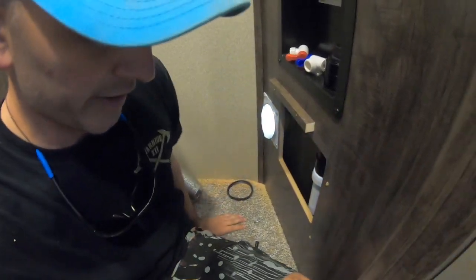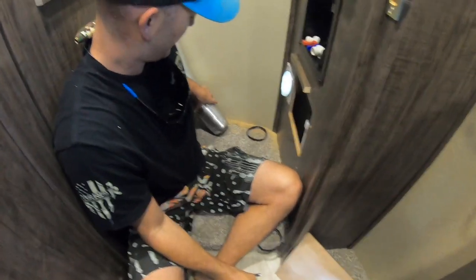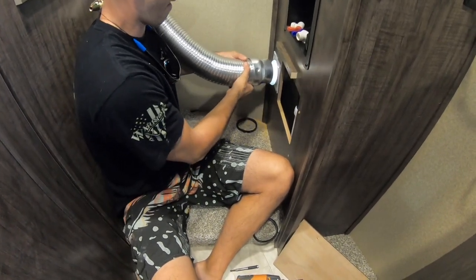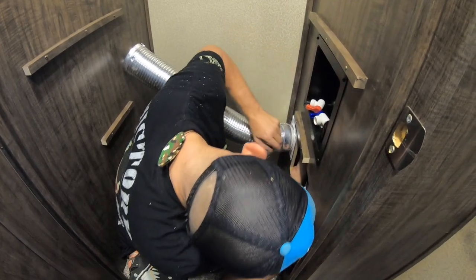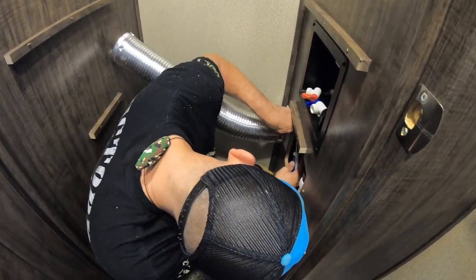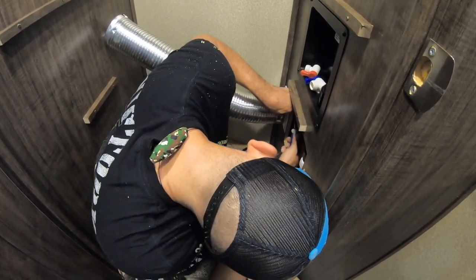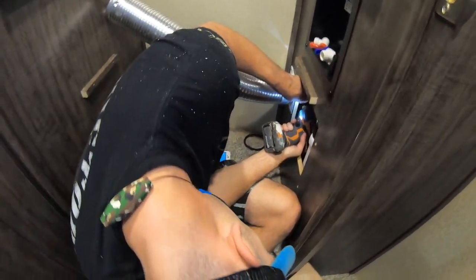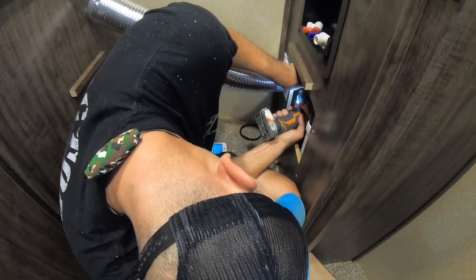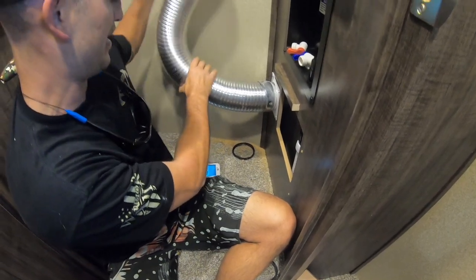Our interior flange has been installed. I'm going to give it a little tug to make sure it's nice and stiff. I'm switching to a five-sixteenths inch nut driver for the clamp. As I slide this dryer vent sleeve in, I'm going to push against it firmly — not really hard, just like so — and then hold it with one hand and make sure our vent clamp is in a position where we can get our drill on it. Sometimes you have to take a screwdriver and tighten it up a little more snug so the clamp will stay where it's at. Once you have this in line, put your drill on it, crank it down, and then it's not going anywhere. We now have our dryer vent nice and tight — give it a nice firm tug and it's rock solid.